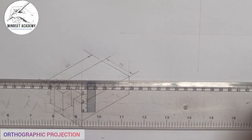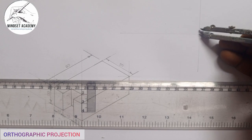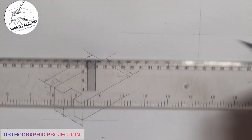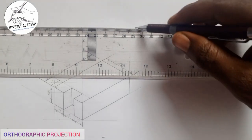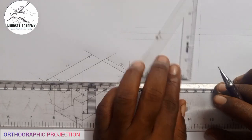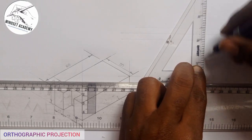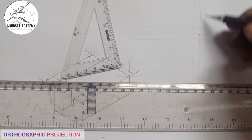This is the first thing you will do. At the point where they meet — this is your X and this is your Y — you are going to measure 10mm, or 5mm away. Measure 5mm on your metal rule: mark up 5, mark down 5, mark left 5, and mark right 5. Then take your rule and draw a horizontal line this way. Draw another horizontal line here, and draw a vertical line here too, and another vertical line here. Those are the 4 lines we have. Nothing must touch the center line.